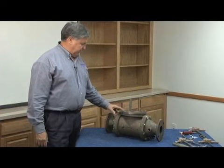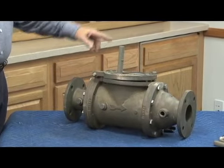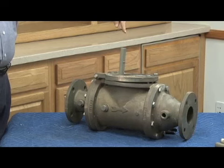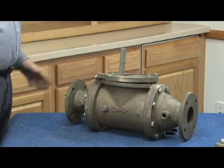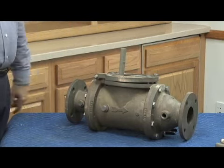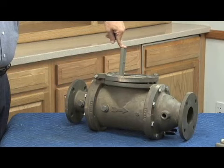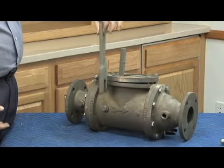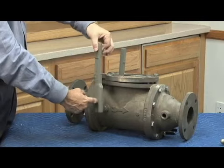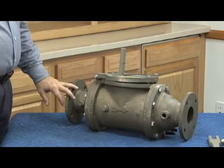The large flange 900 series — this being a three-inch, bronze body. Four- through six-inch was cast iron body. Special tools are required. What was unique is the special tool had to be inserted when the valve was still pressurized — before you shut it off. So you would walk up to the assembly, insert your tuning fork in there, then shut the shutoffs off and drain the test cocks to drain the body. The tuning fork inserts through the relief valve discharge and holds on the center of the relief valve stem.